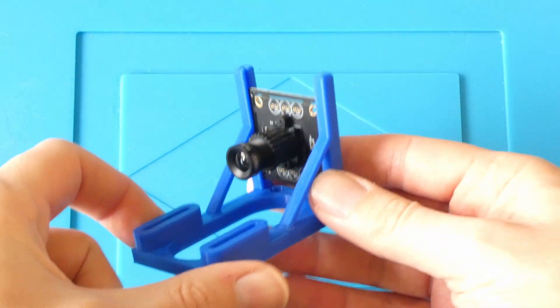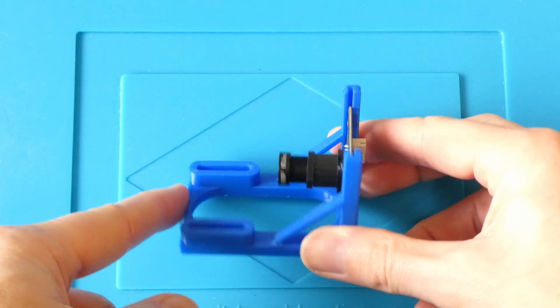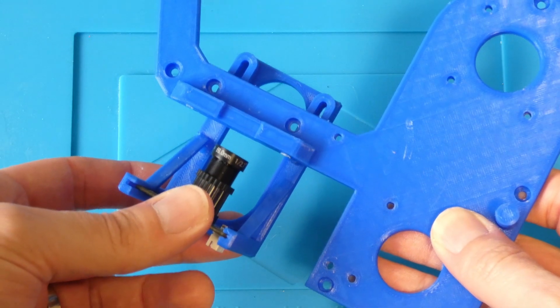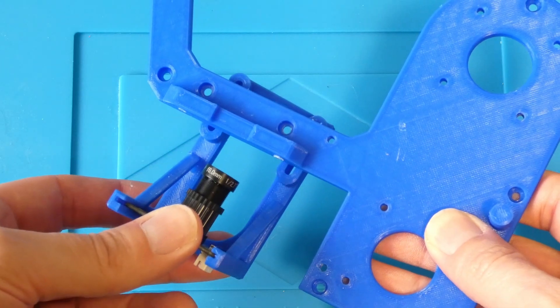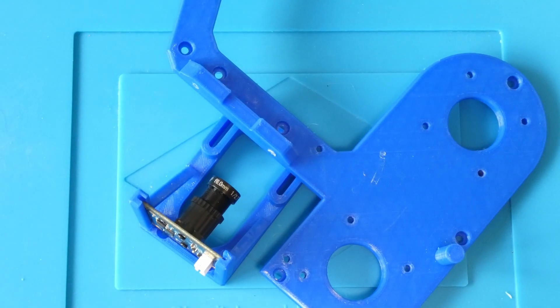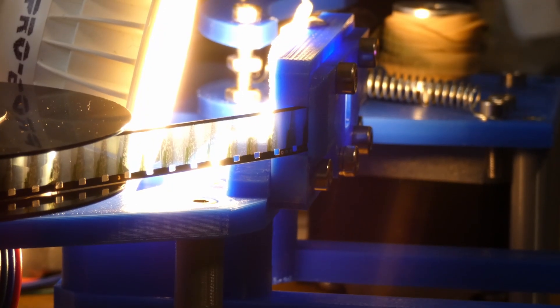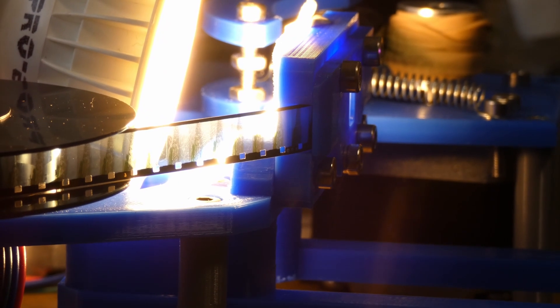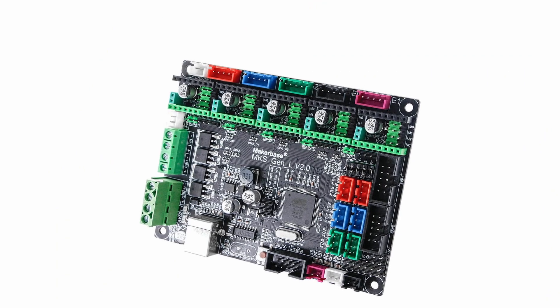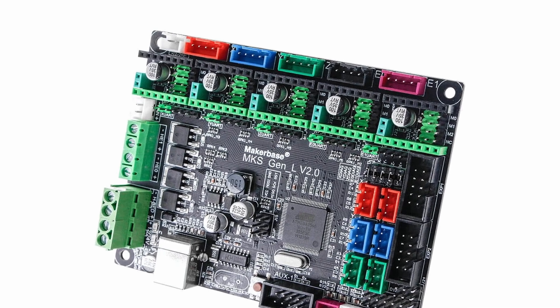A film gate is quite simply a rectangular opening which we use to focus our camera into. For this prototype I'm using one of these very simple 1 megapixel cameras with a 6mm lens, mounted onto a 3D printed sled which can be adjusted and focused onto the film. My goal for this first prototype was to write some code to capture a still image of each frame and stitch them together into a video. For the light source I'm using a 12 volt LED light bulb, powered from the fan output on an old RAMPS-style 3D printer control board. I'm also using this board and the Marlin software to control the stepper motors.